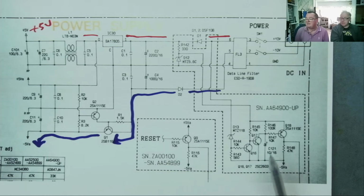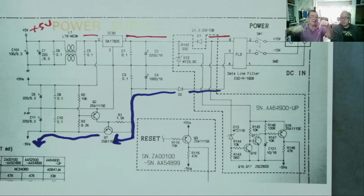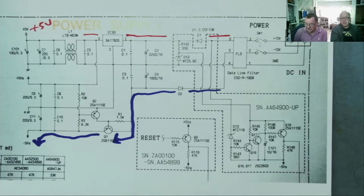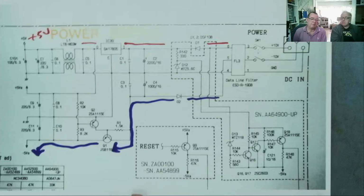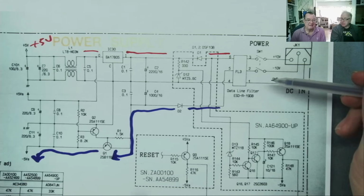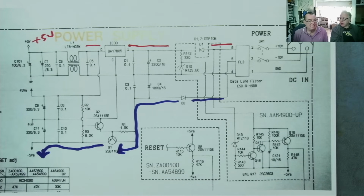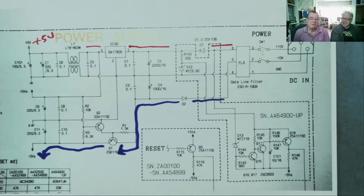If you got a bit more clarity, I think I've got some good idea what this actually is doing. But maybe we'll talk about that one later. Okay, so you can see we need to solve this problem. We need to somehow get a plus and minus 10 volt DC supply into here. And we actually came up with 2 completely different solutions. Well, 3, because the cheapest one I just thought about, you could use 2 9-volt batteries. That would probably work. But other than that, I have one solution and Dave has another.